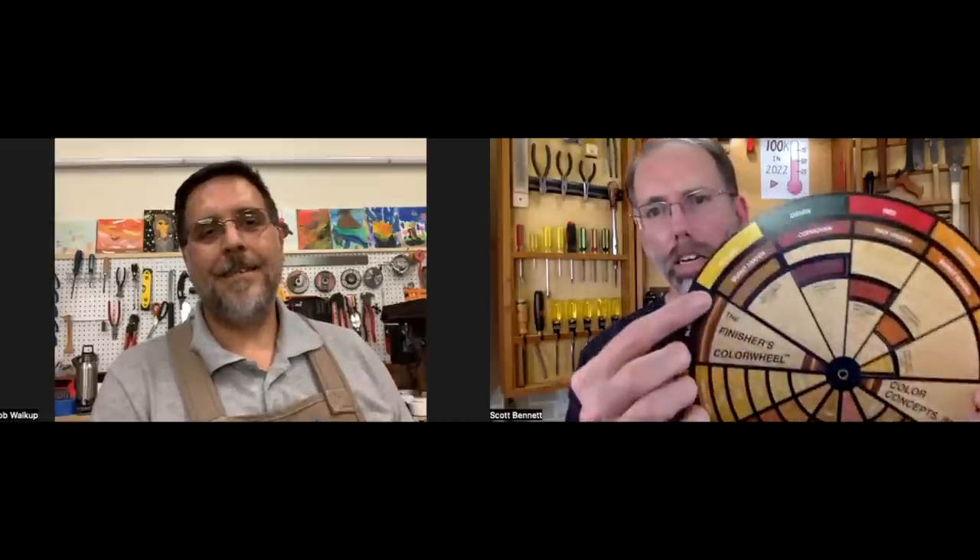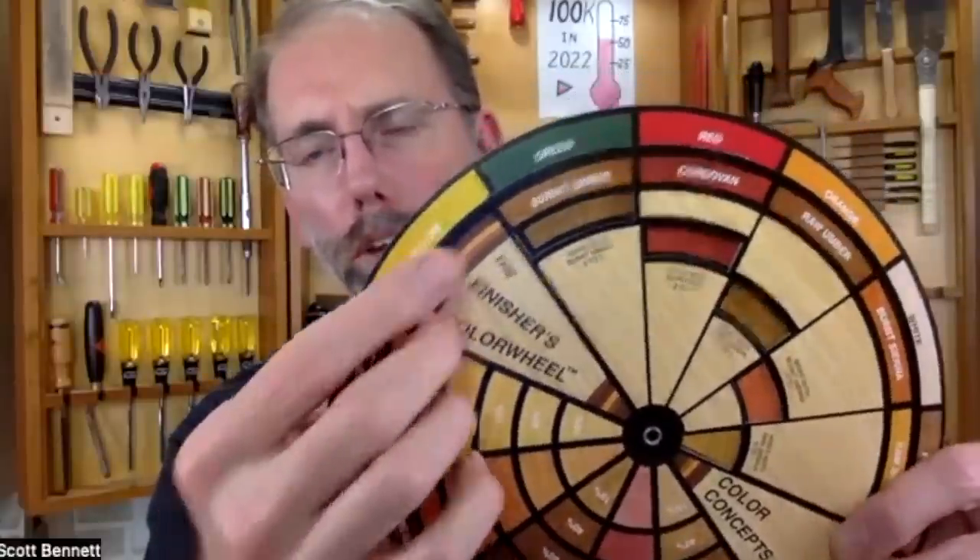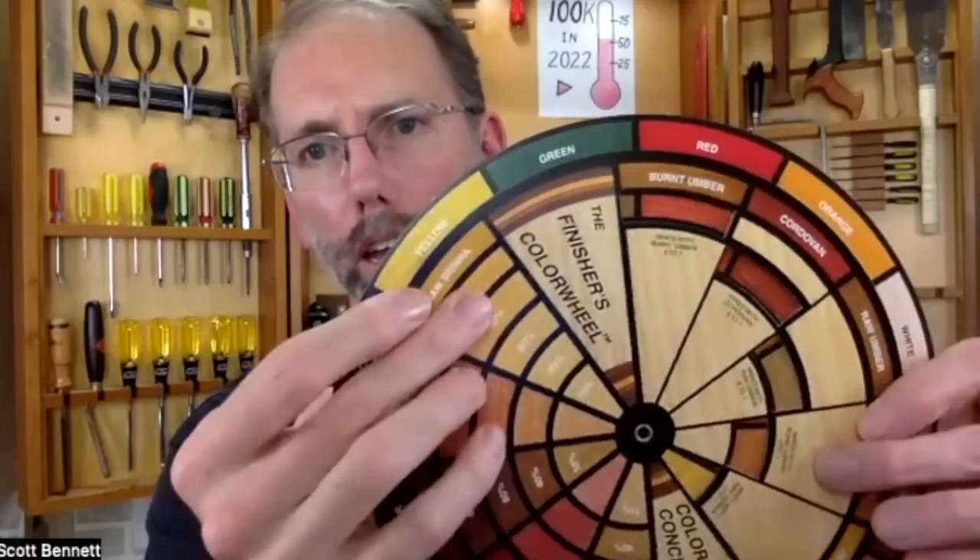So you can use yellow and red to scale your color back and forth until you dial it into fairly close to what you're looking for. You always try to make it a little lighter, a little brighter, because once it cures and you put a finished coat on it, it's going to darken up just a little bit. For people that aren't familiar with color theory, there is something called a color wheel for furniture — it's more browns, not those artistic colors. It actually shows you if you were to mix yellow and burnt umber, this is the tone you would get. And if you rotate that over where you add green to it, you get an idea of what that color looks like. You add red and it changes the color, so this can help to start with.